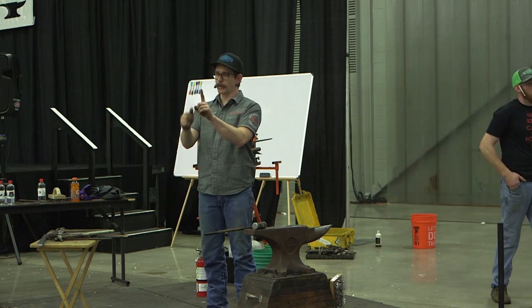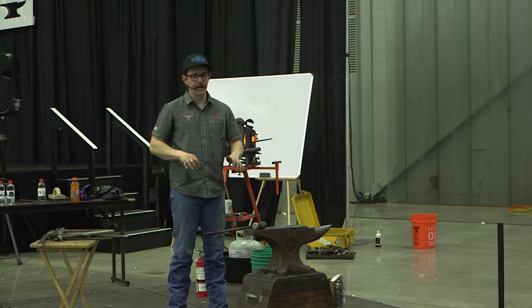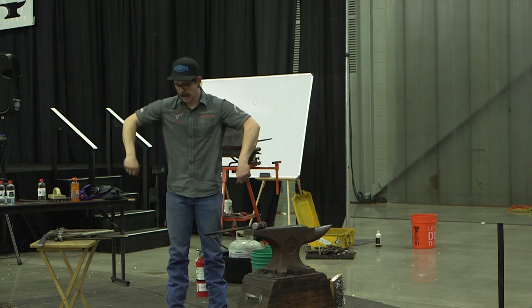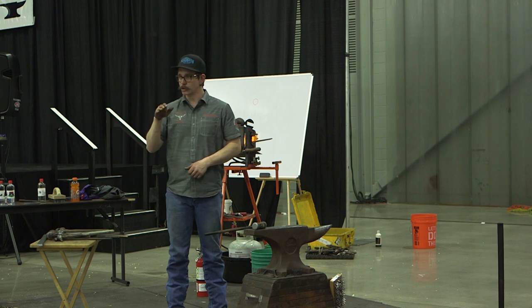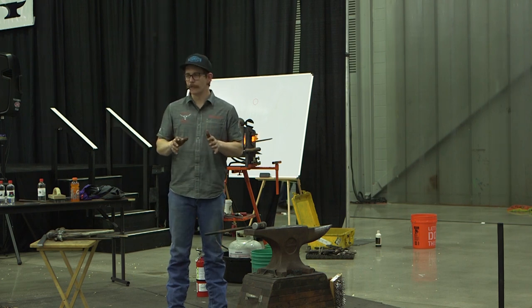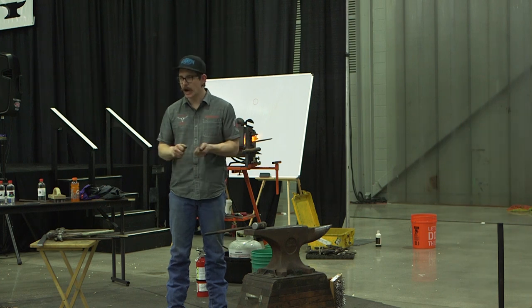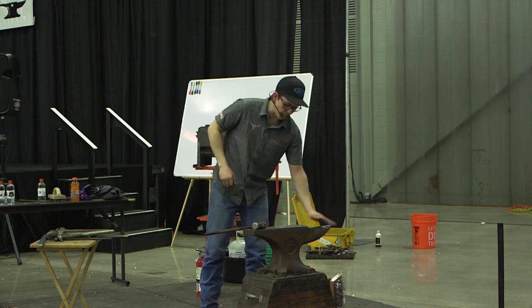And so I want to put that up in the forge, so it's potentially hopefully getting hotter the fastest, but I need to be mindful that everything's hot. And so I can't just go ahead and rivet and then start ripping them apart, because I'm just going to ruin everything in my shoulders. So I need to kind of quench up to those shoulders when I first start, so I can be preventative enough, and then wait for them to cool enough that it's not real windy and hot and just going to go everywhere on me. What else is important when you're going to rivet?